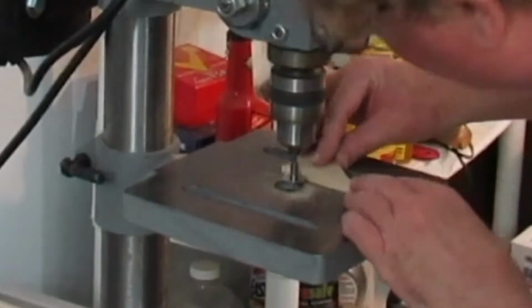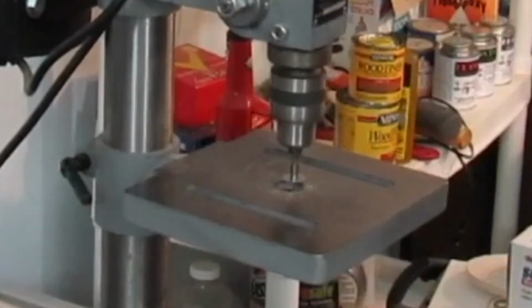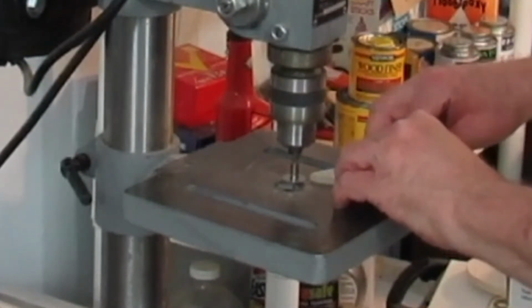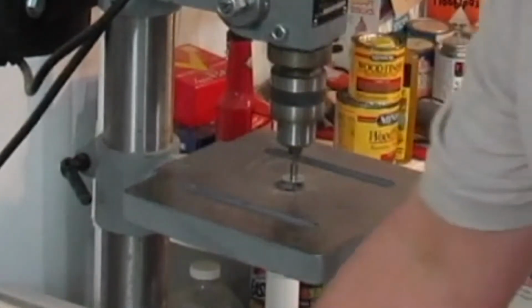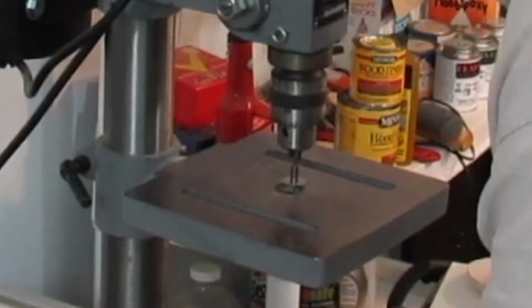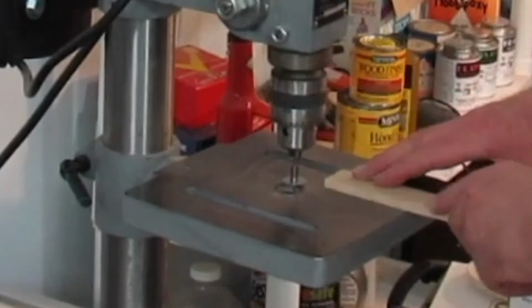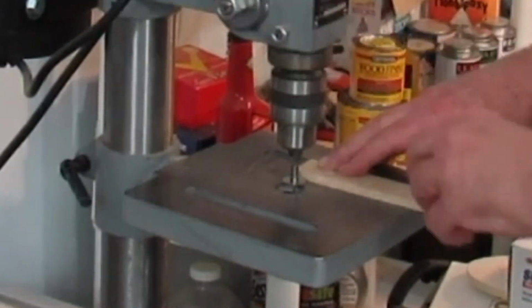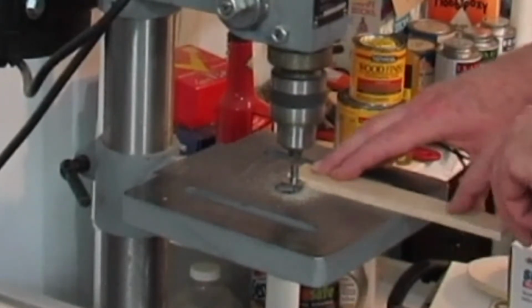That looks dead on. And it feels dead on. So I'll lock it down. And you will go toward the motion. Instead of starting with a complex part or a bigger part like a stab half, I'm going to start with an elevator piece because they're much easier to replace. And you don't start all the way out at the end. What you do is start in from the end and then pull it back and then start cutting.